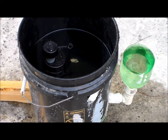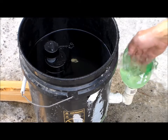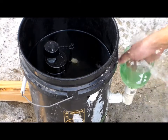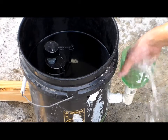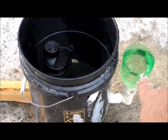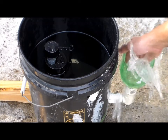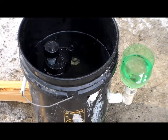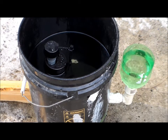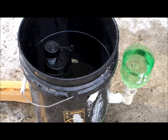I'm going to turn the water back on. So I set it down and it stopped. The drinking bowl is going to constantly be at the level of the bucket. As you can see, it turned on right away. So we still may want to adjust it a little bit — I'm going to bring that float up just a little bit and see what happens.